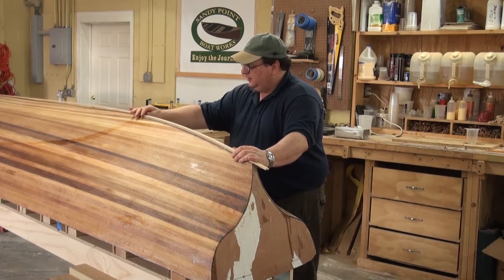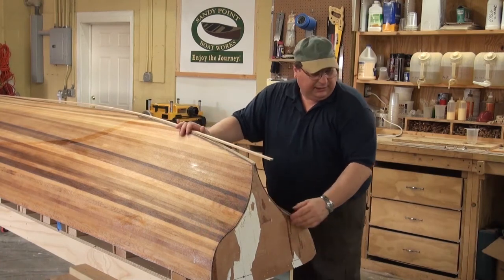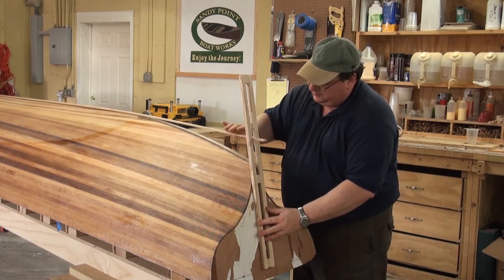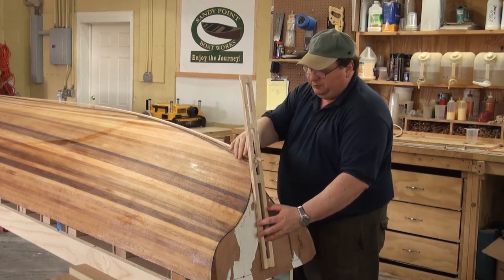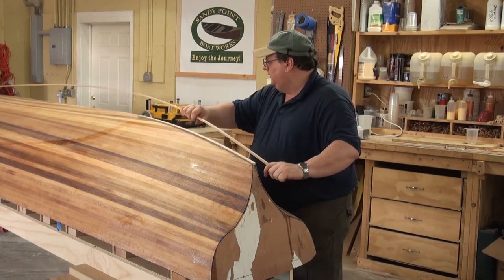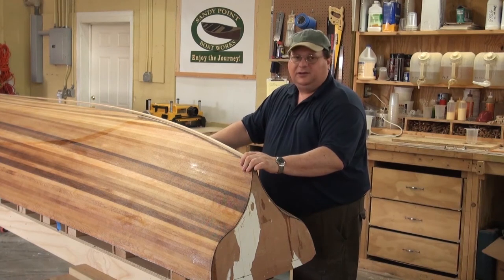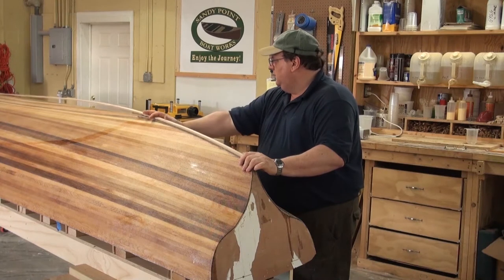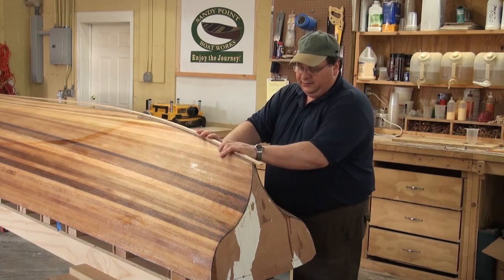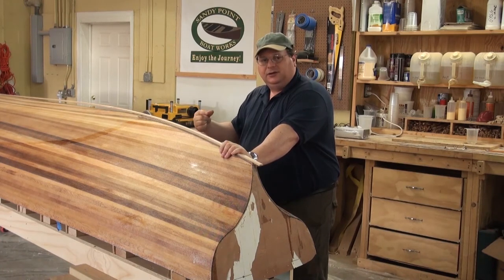We need to put this on here using some tie-down straps and in my case a couple of staples, but first we need to put our jig back up at the back end so we stay on track. The jigs are going to slide down in between and we'll mount them going straight up the boat. Now the strip I have here is not long enough, and that's fine — we're epoxying it down so whether it's one or two pieces doesn't matter because the epoxy gives incredible strength. I'll let it go within two or three feet of the end and splice a short piece in up there. Then another piece will go from there all the way up and around the stem, connecting everything together — just making sure the two joints aren't at the same place.